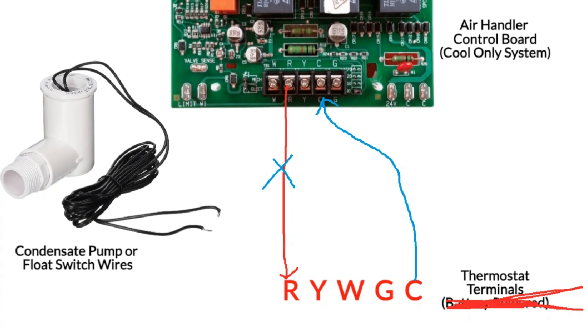What ends up happening is that we end up with a dead thermostat. This really isn't all that big of a deal, but the minor disadvantage is that if you do end up with a dead thermostat, it might not come on right away when you fix the water problem, or you can lose functionality for a while until it fully charges back up — which in some cases can take a full day. You might lose Wi-Fi ability or other smart features. So a better way on a smart thermostat with a common wire is to actually break the cooling signal coming back from the thermostat.